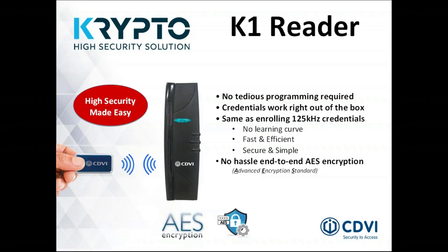And that will allow you to tell each individual reader on the building, here are my encryption keys that I've created. And when there is a card that is presented to you as a reader, if these keys in the card don't match the keys in the reader, simply don't read the card. Okay, so ignore the card if things don't match. That's all fine and it's great stuff.